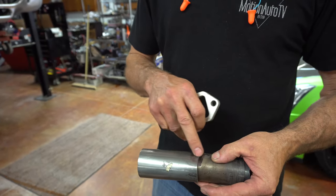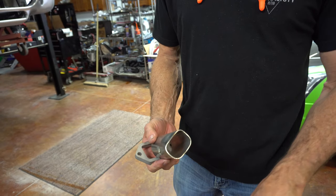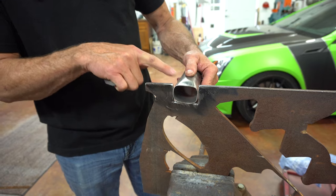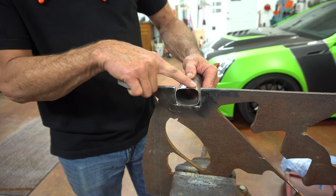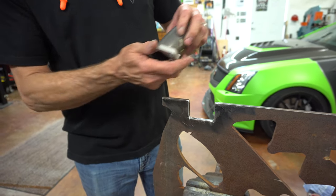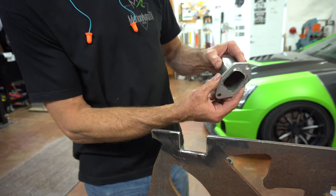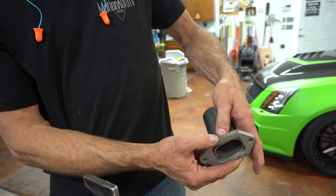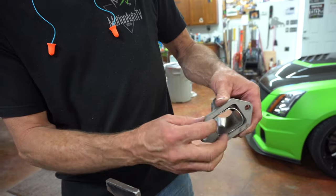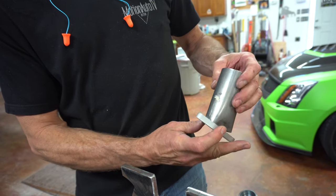He made a little fixture that fits inside the round pipe so it can start turning. He puts flats under it, marks where it's straight up, presses it down to get it pretty close, then moves to the vise where he can hammer-form and mold it. Once you get it close you can still rotate slightly by pounding down on one side or the other. It looks crude to start but you get it in there - then tack it on the outside, hammer-form it out, build a nice transition, and weld both inside and outside for a clean fit.